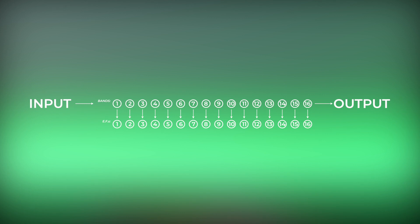With a high amplitude they output a high voltage, and vice versa. By using the CV resulting from an envelope follower to control the amplitude of another band, one could transfer the energy of the first band to the second one. When done at a larger scale, this is the working principle of vocoders.